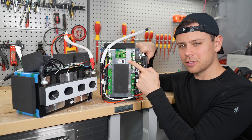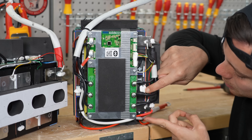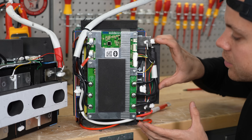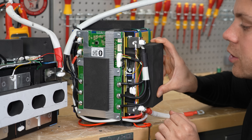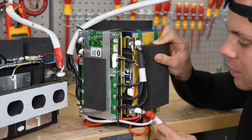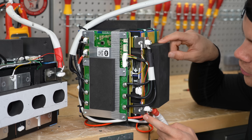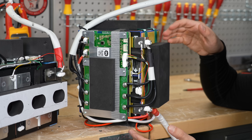Now there's a temperature sensor for the BMS and only one for the cells — it's mounted right here and the heater pad is right here. They should have the sensor closer to the center, and for heated batteries they should probably have multiple temperature sensors. Usually with these heater pad batteries they're not triggered that often, especially if they're indoors, and it increases the complexity and price. I'm not a big fan of these heated batteries. Also you cannot put them into series for 48 volts because one battery will always be triggered first, and then the heat pads will discharge that one battery and create an imbalance in the string.